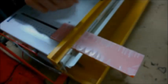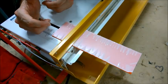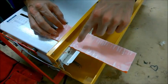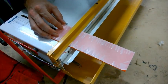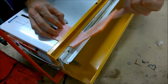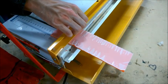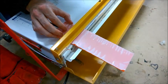Going back to our thermoplastic piece — this has been sitting over the line bender for the desired time, around about 105 seconds. What I generally do to test this is keep feeling it with my hand over here. What we're after is a level of flexibility in the plastic. My rule of thumb is to use a very small finger and just lightly lift it on one side. If it freely moves and pings around, we know it's ready to be thermoformed. So I'm going to repeat the process in reverse — lift the guard up and bring it backwards, making sure it doesn't fall out the front of the guard, and carefully slide the acrylic out.